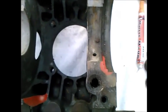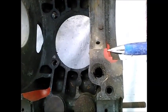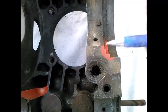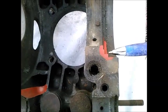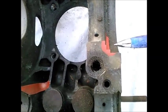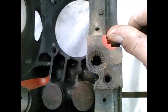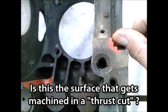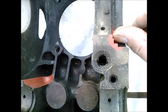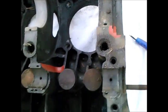I'm also a bit puzzled by the number of steps here. I know there's a means of remachining the thrust surface, but when we say that — this is the seal surface, I'm not sure what this other surface is, and then there's this surface. I can feel a lip right here, so maybe this needs to be machined again. Is this step always preserved when the thrust surface is remachined? I don't know. I could use some input there.